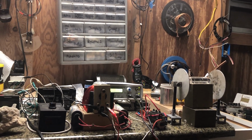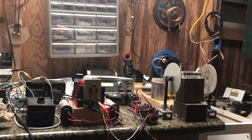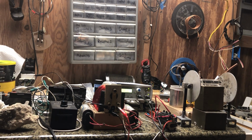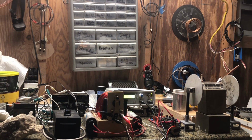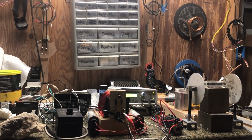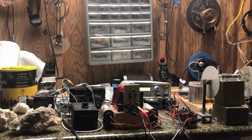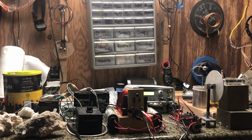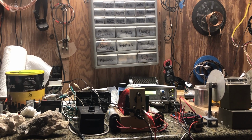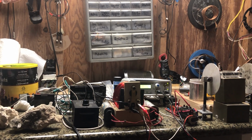Quartz and some other crystals of similar atomic nature have the property, when exposed to potential excitation in a definite direction, of stretching and contracting, and using rapidly changing potentials, the crystals will change the electric waves into mechanical oscillations. This piezoelectric effect, shown in Rochelle salt crystals, by which they may be made into sound producing devices, such as loudspeakers and microphones.